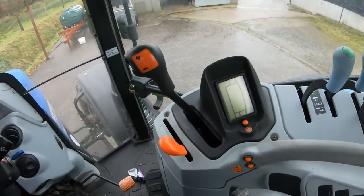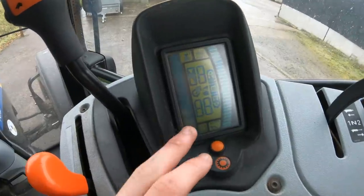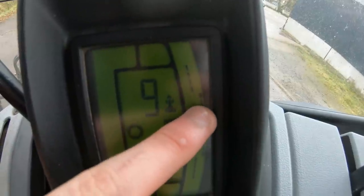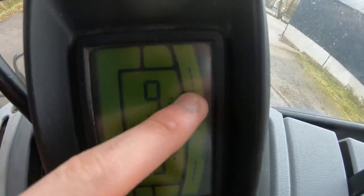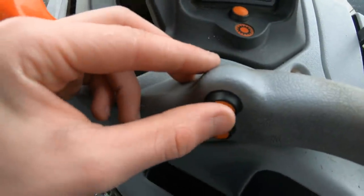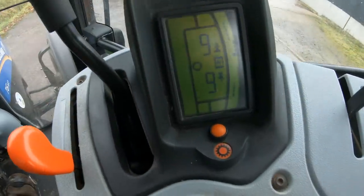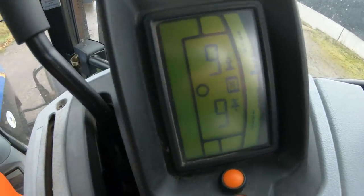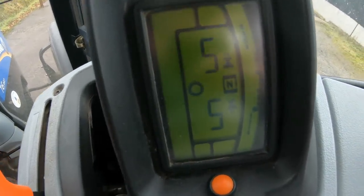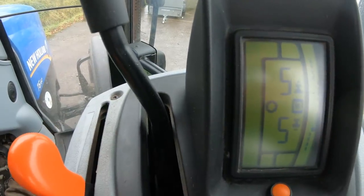Now when you come over here, I'll turn on the ignition for this. So as you can see it'll start on 9 and you have 9, 10, 11, 12 - you have to clutch it forward - 13, 14, 15, 16. And you can use this button up and down here. Then to get it into the lower box you have to clutch it, pull this handle back, and as you can see it's then in the lower. To go back up, push it forward.